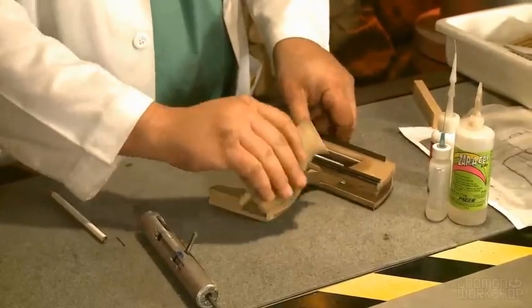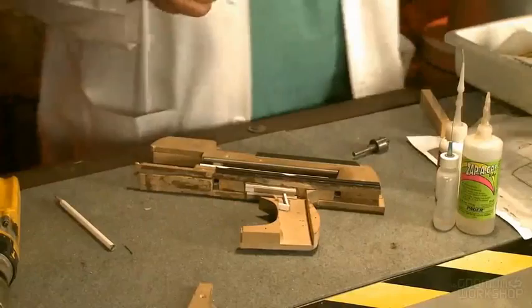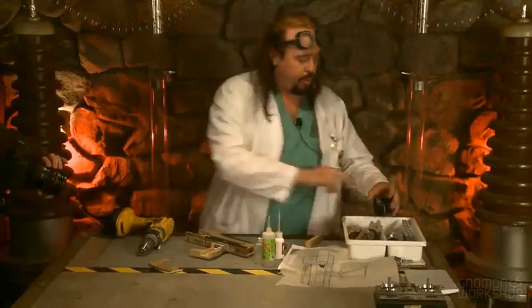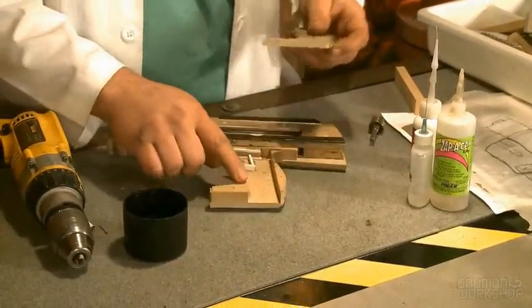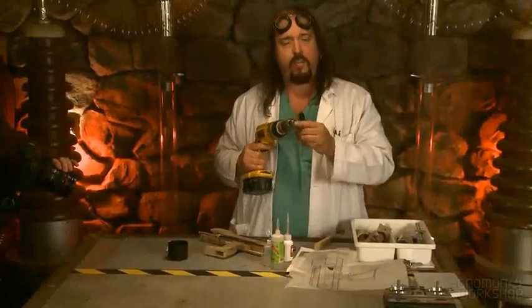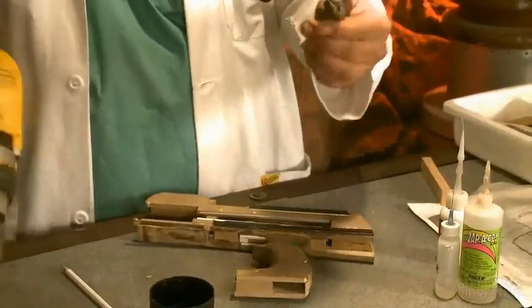Let's take our pattern here — this is a little bit more advanced, obviously done a little bit earlier. Some fun things you can do: little tricks. You can take a small nail if you don't have a small drill bit, so that you can lay out your screws. Lay out your pattern so that you go through the shell on the outside and into the spacers on the back side. Take a small nail, cut off the back of the head, drill out your hole, and then countersink it using one of these, or use the back of a larger drill in reverse.